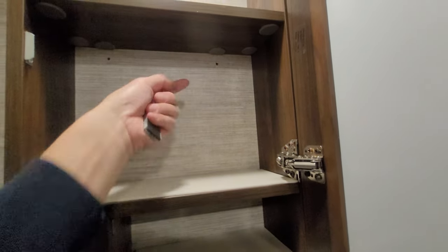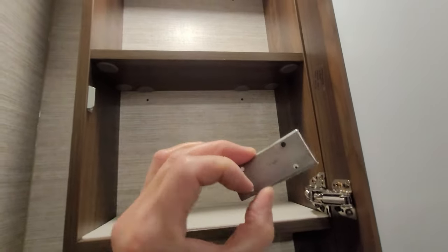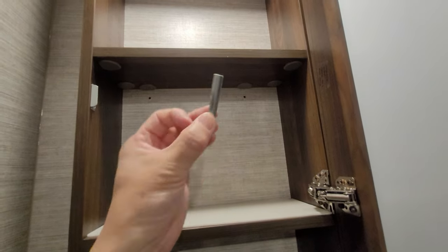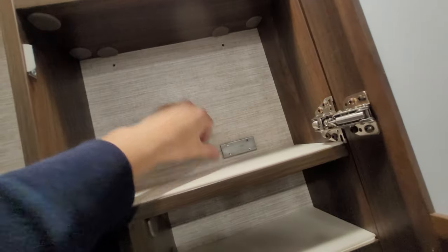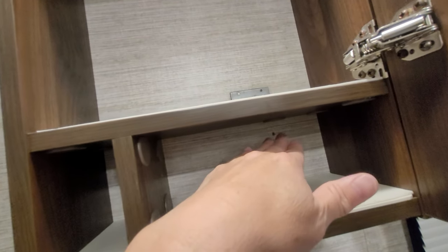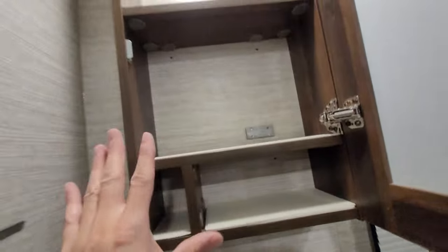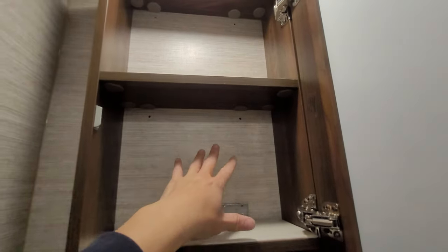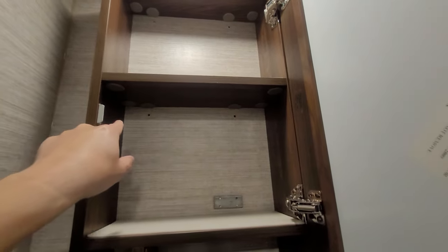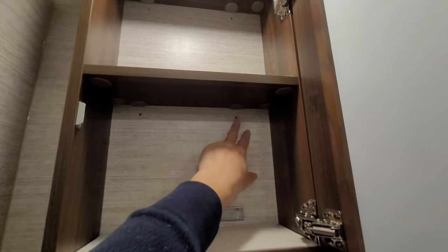What they do is they put a metal backing on here. The reason my cabinet fell off is — remember that magnet I used on the stair trick? There's no metal behind there. They actually mounted the cabinet almost 2 inches too low. So when that happened they missed all the metal backing. See how this magnet sticks now? I had to take this cabinet out and raise it up about an inch and a half so I could actually hit that metal backing. Now these old holes are left behind — let me show you a little trick I do to fix these holes.